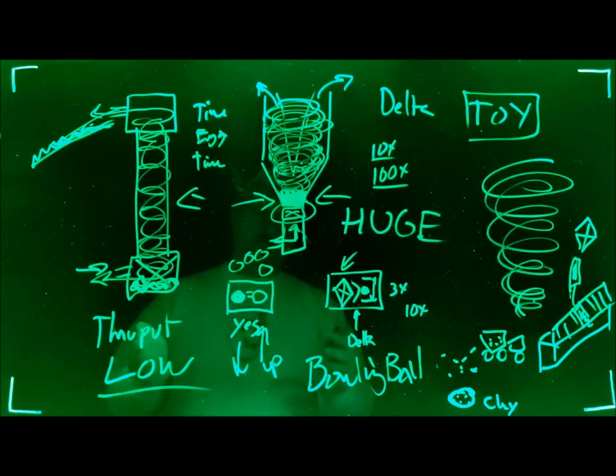It catches flat gold, doesn't catch wire gold, well, not to say it doesn't catch, you keep pushing it up. But chunky gold, brown gold, it just has trouble with, because that's just the way the fluid works. You're dealing with such low flow and you're trying to get those small pieces of gold laid down and let the secondary boundary layer, or the fluid flow, because it's so small that it actually really isn't hardly developing a secondary boundary layer, jump over top of it and pin it down with the force of the fluid on top of it. But anyways, that's how a Miller table works, so we don't really need to draw that.